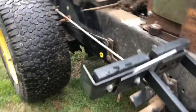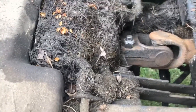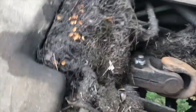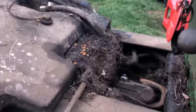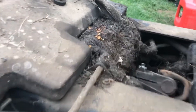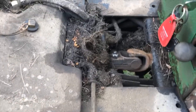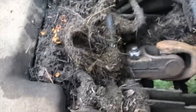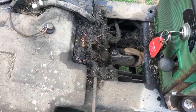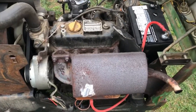Another thing — after it sits a while, it's been leaking some hydro oil. I believe the input seal is starting to go. It's really moist and kind of runs down the differential, as you can see there. After the seal isn't swelled up it starts to leak. I think the check valves are leaking too with all this mess of grass. I might have those redone, but I'll definitely do the input seal. I'm going to clean it up and do the baby powder treatment just to confirm it's leaking there.